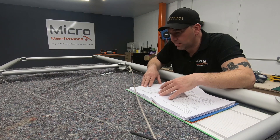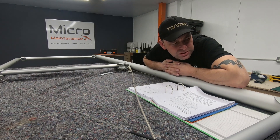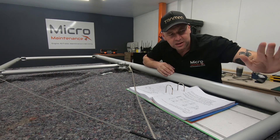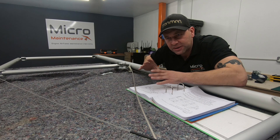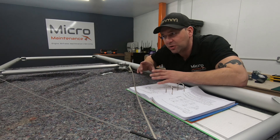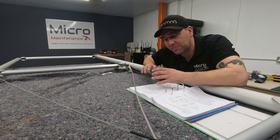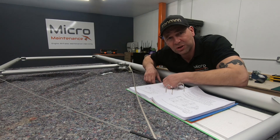Mock-up is complete. I'm happy with everything, so I'm going to start tightening up some of the bolts. It's worth bearing in mind why certain things are there — we'll come to the bracket when we get to drilling. Whenever you're tightening any nut and bolt on a tube, you're not sending it home as hard as you can. It's very easy to crush that tube. Once it goes, it will go very slack, and you'll think it must tighten up at some point. Be mindful when tightening nuts not to crush those tubes.